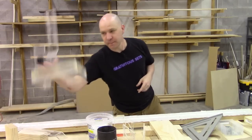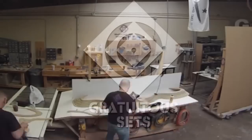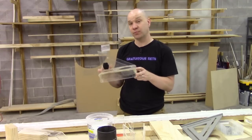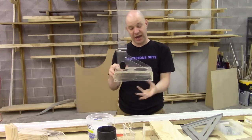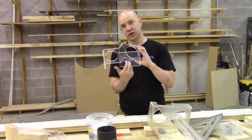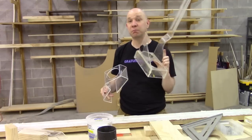Moving on — playing with plastic, I'm going to remake our unfortunately late dust shroud for the CNC machine with a couple of modifications. Since the move, our CNC machine is in a different configuration, so our natural start point is down at the bottom where it's overhanging the edge. The suction is just sucking void — not actually getting dust from that side. So we're remaking it more like a scoop, so suction comes from here and always pulls from here. We're also putting the door on the other side because the desk is now on the other side, and I'm going to make it less broken.